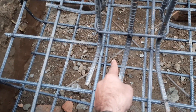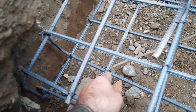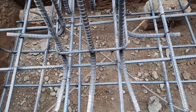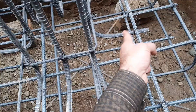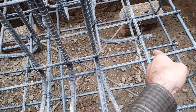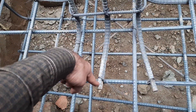The leg length is nine inches on each side — this is a double mesh box. The concrete cover is not okay. They provided eight steel rods in this column. The column size is 12 by 12 inches. The leg length is about nine inches, which is correct. The stirrup diameter is 8mm, but the spacing is not perfect according to the steel structural drawing.